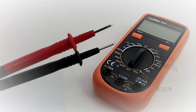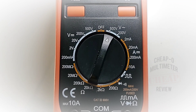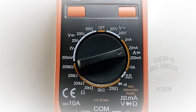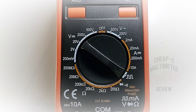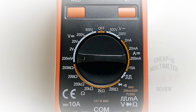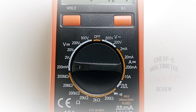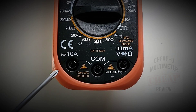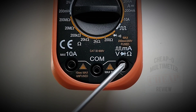You want to keep it on the low voltage side with these test leads for sure. The range positions are: off at midnight, volts AC up to 500V, milliamps from 2mA up to 200, high current unfused up to 10 amps, signal generator, resistance up to 200 megaohms, and volts DC from 200 millivolts up to 500V. Top left is touch hold, right side is backlight. Bottom inputs: 10A high current, common, and signal generator/milliamp/volts/diode/resistance.